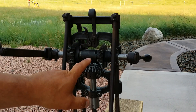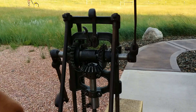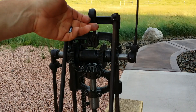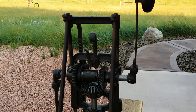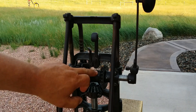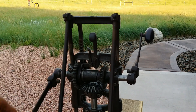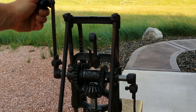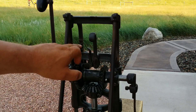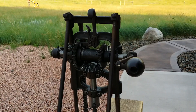The horizontal shaft that you drive with the handles meshes with the vertical shaft. To drill holes, we slide this over and this little lever flips down and rides on the slip — you can see these gears right here, how they're disengaged. That allows it to spin freely so we can drill our hole. When we get to the end of the hole, I back it up a few turns, flip this lever, it clicks in, locks the main horizontal shaft into the lifting gear, and then we just pull it up out of the hole.